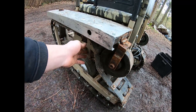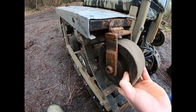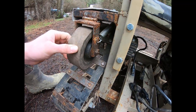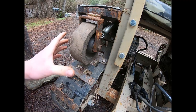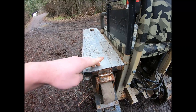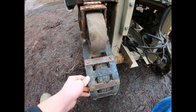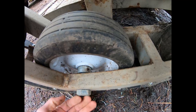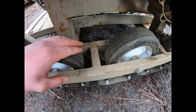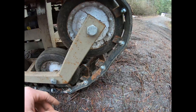We need a way to tension the track to keep it tight and prevent it from skipping teeth on the drive sprocket. My solution was a wheel carrier that is spring-loaded with a trampoline spring and welded on with a hinge to give it a pivot point, pressing the track right into the drive sprocket. This is welded to the fenders which are bolted onto the main frame — added later, which is why they're not painted. Tracks do stretch over time, so this tensioner is absolutely necessary. The wheels sit in the frame and are kept from rubbing by a collar on five-eighths-inch smooth-sided bolts.